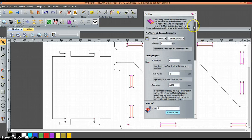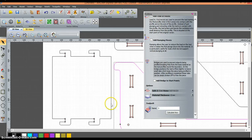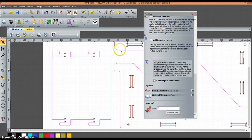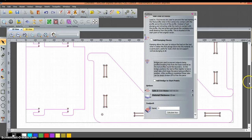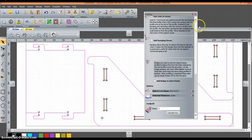Next we're going to do the outside profiles — this will be the last cut, so we'll flip this to Outside. Everything should be automatically set up. I'm going to call this toolpath number 3. Finally, I'm going to select my profile — this one, this one here, and this outside profile there. Holding down the shift key: a good sign that your toolpath is correct is when you select it and look out for a little green dot. If a green dot appears, that's feedback to say that the profile is correct.